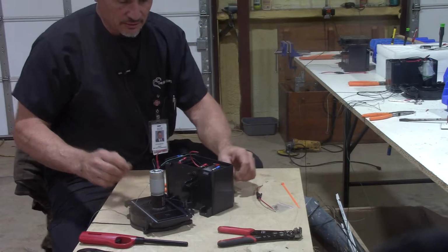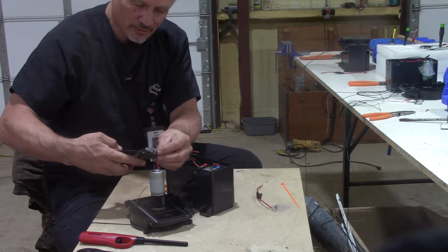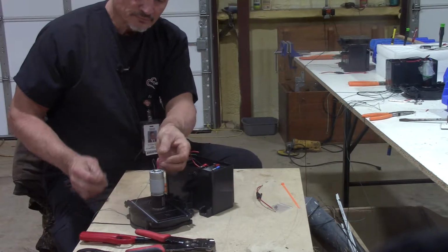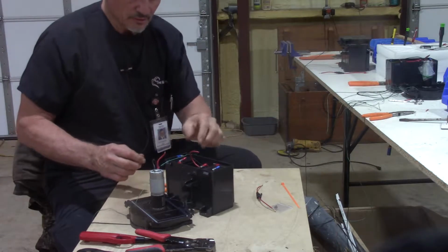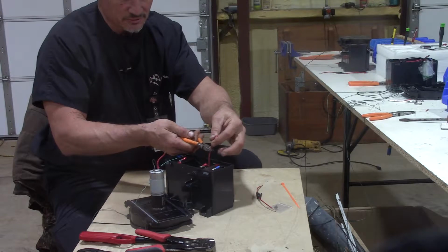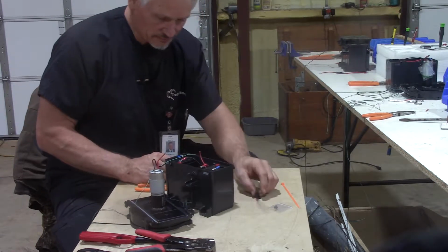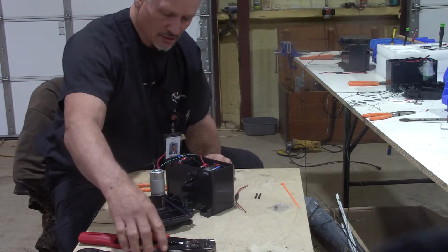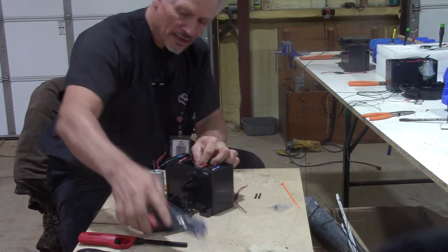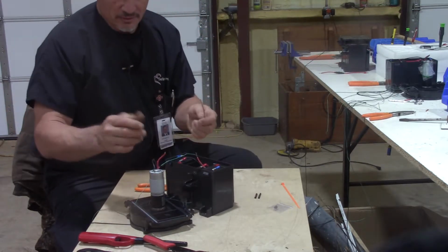You got that done, then take a wire stripper or pocket knife, something, strip off 1/2 inch, 3/4 of an inch of the rubber on this wire on the motor. You see that? And then you can cut another 3.5 inches off of this one because you don't need all that wire. Just throw it away. Another scary thing if you're not sure what you're doing. And you're going to have to strip off another 1/2 inch, 3/4 of an inch off of that wire. Doesn't really matter what order you do it in.